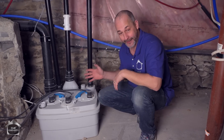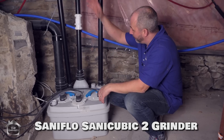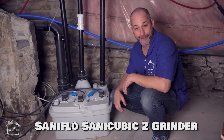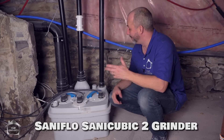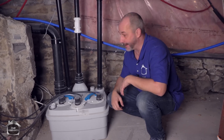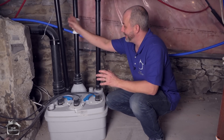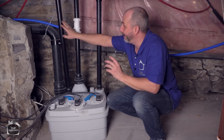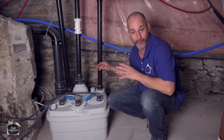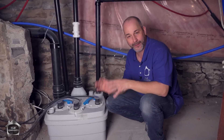Speaking of creative plumbing, here's my Saniflo macerator — this is an awesome Saniflo Cube 2. It's an amazing machine because it allows me to bring all the plumbing from the whole house and dump it in. What you just heard was the blender going on — it shoots it up through this check valve right out to my septic tank. Over here is the fresh air intake, but it's so far from where we're going and has to be dedicated just to this machine. So what we're gonna do is cut here, run a line straight over to where I'm going to put my new laundry sink, and tie right in with a tee. Good as gold — I can add on to this system all day long as long as I use that inline vent trick to add fresh air to the fixtures.